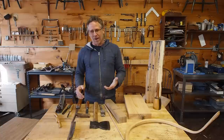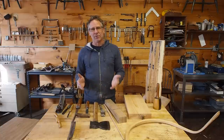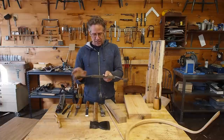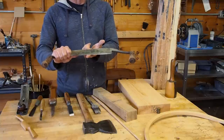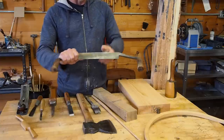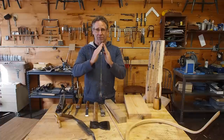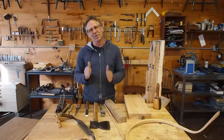Another thing I want to talk about with these steel tools is what happens when you skew and slice with them. Because really what you're doing when you do those two things is you're affecting the angle of the edge as well as whatever angle it was initially sharpened to. So for instance, if I travel straight up the back of this tool, I'm really using the angle that this is ground to. But every bit that I diverge from that, every bit that I go up the side angle here, even more so by skewing it, or slicing down the way, that effectively lowers that angle. So that actually makes this blade that was ground to be sharp like this, act like a blade that's like this. So I'm kind of getting what I wanted in the beginning, which is a thinner edge.